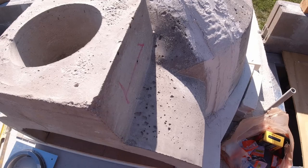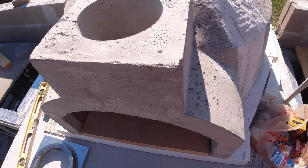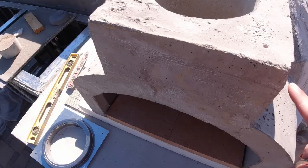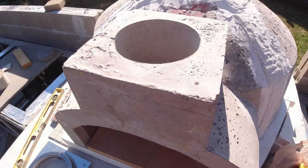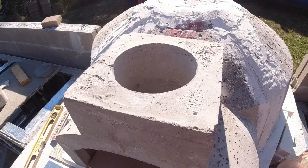I used the Bosch hammer drill. Worked great. There was a little bit of puckering on drilling this. You can see there's a couple of corners that it came to already broken. I could just see me drilling this, and with my luck the whole corner just splinters out. But it didn't. We're good. So let's go ahead and get the mortar mixed up and get the anchor plate on.